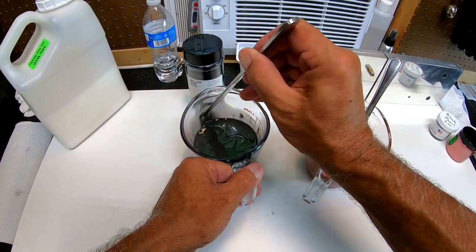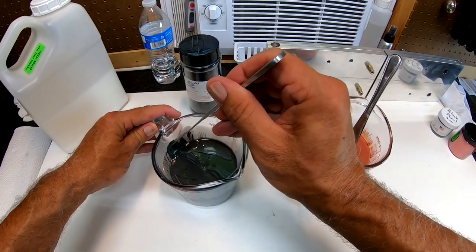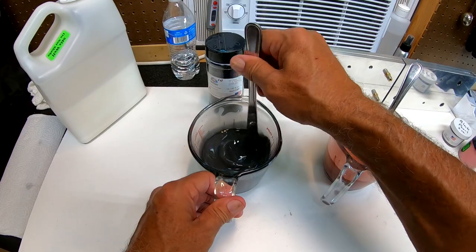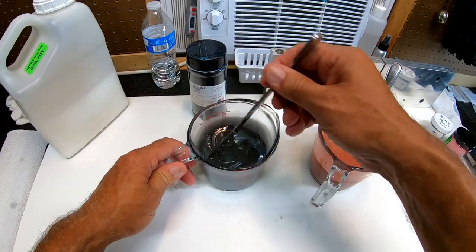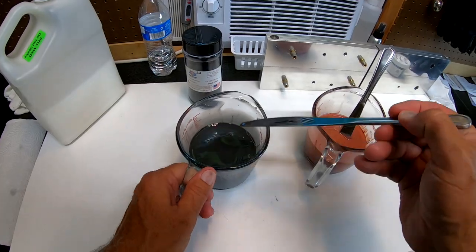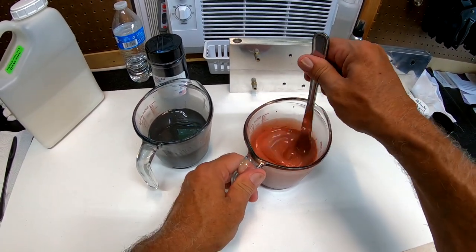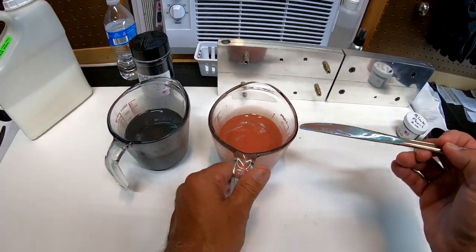I have actually reached out to other guys that make soft plastics and say, look, I've been faced with this challenge. I can't seem to get through it. I've shot hotter. I've shot cooler. I've changed everything I could possibly change. It could be the mold. It can be your injector blending block. I've had an issue with a blending block before where colors actually started mixing in the blending block. So there's a lot of challenges out there. So don't give up. Don't lose faith. Don't lose hope. Fight the good fight. And just realize that you're not going to be alone in this battle.